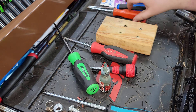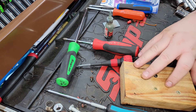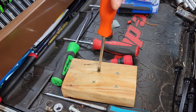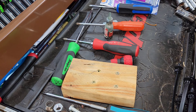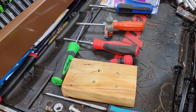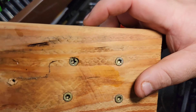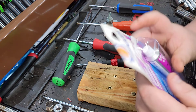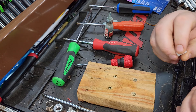So since we know the Mac screwdriver was the worst one, can we make it operate like the Vessel by adding this snake oil? That's what we're here to find out. The proof's in the pudding — it does in fact give you more grip. It still does cam out a bit at the bottom but I can actually feel the grit in there. Let me shoot a little brake cleaner in to clean out the hole, then let's try the valve grinding compound and see if that also improves things with the Mac Tools screwdriver.